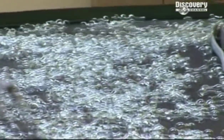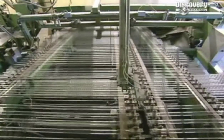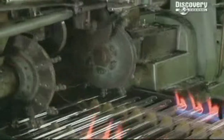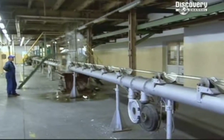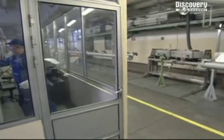But they don't just make standard light bulbs here. This factory produces 300 different kinds of bulb. The production of a fluorescent tube involves a very different procedure. Molten glass is dragged straight out of the kiln and spun into one long tube on a 50-metre conveyor belt. These are then cut down to size and heat blasted at each end. If a 50-metre stretch of glass goes, the whole production line is brought to an abrupt halt.